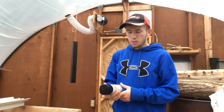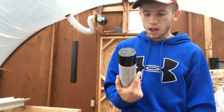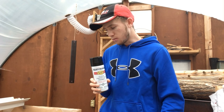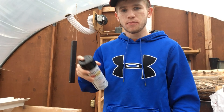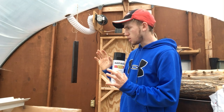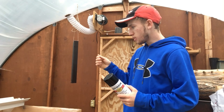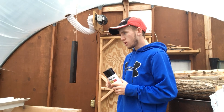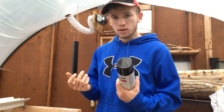Where I'm at it's raining outside and it's real damp and cold, so I brought this inside my greenhouse and hung it off some construction string. I'm going to paint it with Rust-Oleum gloss protective enamel in black. I find Rust-Oleum lasts a lot longer and looks a lot better than Krylon — I'm not sponsored, just doing what I like best. I've already degreased this and not touched it after that because the oil from your hands doesn't allow the paint to stick as well. I blew it off with the air compressor — no contaminants.